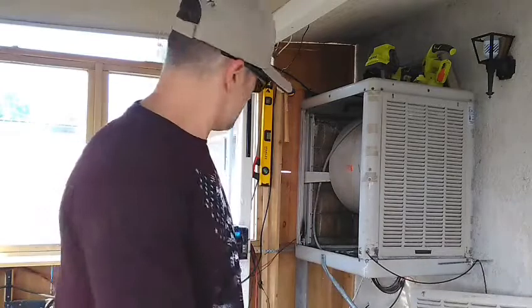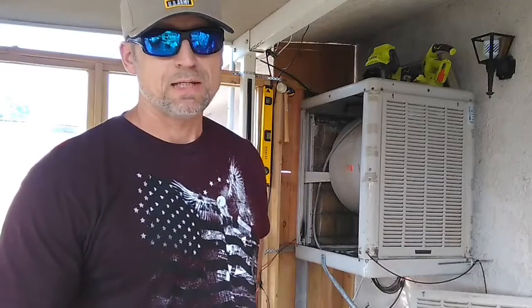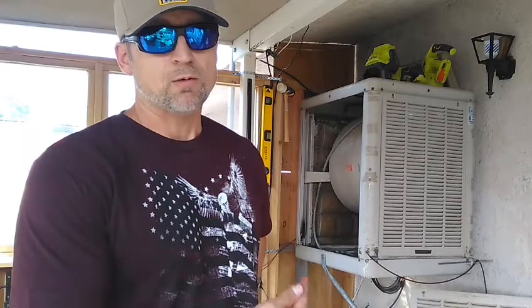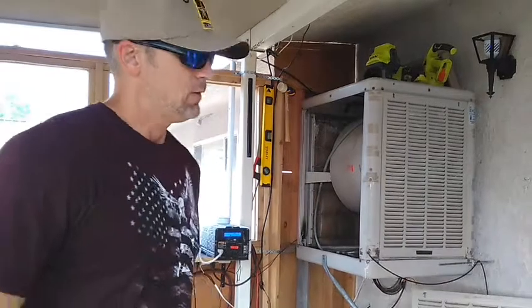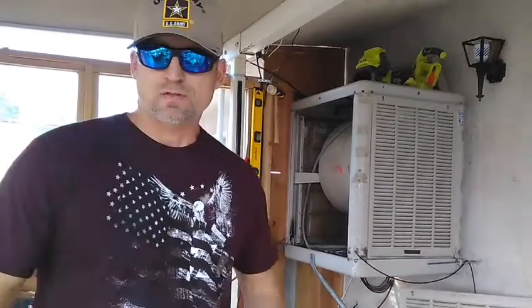Hey, what's up. I've been working on a project this weekend I want to share with you guys because it might help you out if you're in the same situation and want to run things off grid. So last weekend we lost power for three days. I have a battery backup system here that I made, and with an inverter — it's a 3,000 watt inverter, it says 6,000 watt peak — we needed to run our swamp cooler and it would not start. The inverter kept tripping. It should have enough power because it says 6,000 watt peak, so it's probably wrong. It's a cheap model; I paid $300 for it.